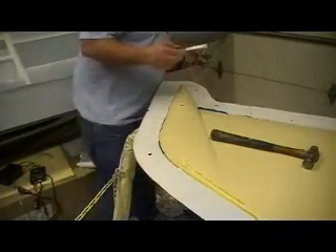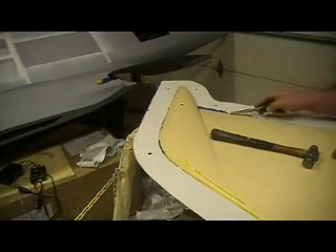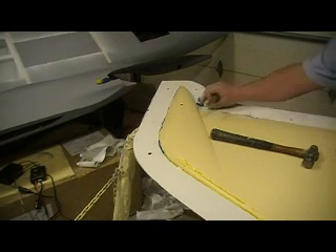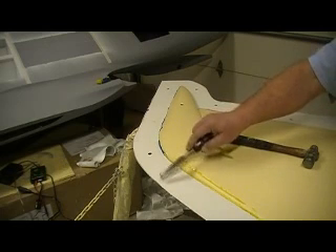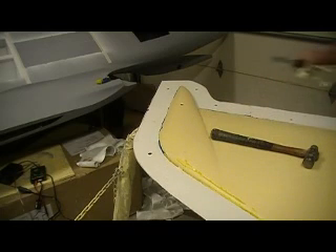Bam! Now I'm going to take my clay removing tools that my buddy sent me — one of my fans — and get this all cleaned up. Put another coat of wax over that whole thing because I've got to get some wax on these parting planes. Now them are my parting planes — the only thing I've got to do is put that board on this end. Now I'm ready to go. Put the wax on — bam! We'll be trucking right along.